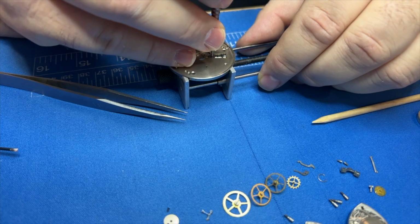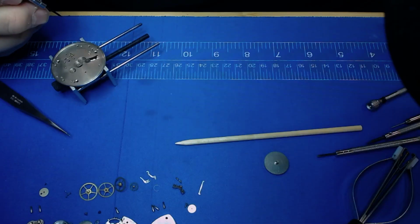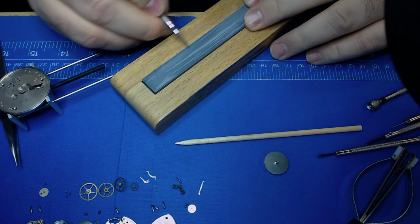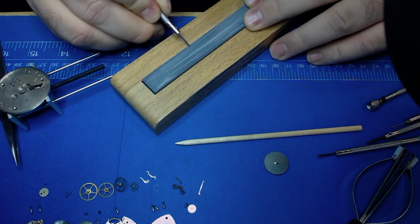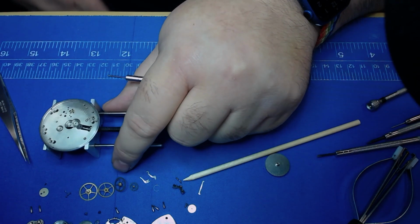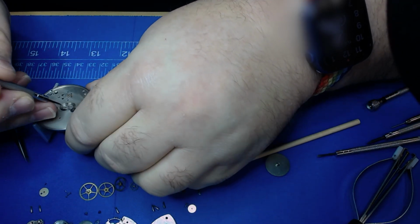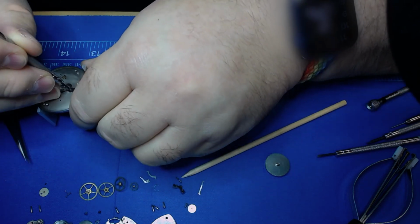So if I take this off, from the top down there's a screw, and then there's a little disc with one end that's been flattened off. My screwdriver's not good enough. This is the problem with cheap screwdrivers, is if you don't have sufficiently hardened tips, when you deal with a hard screw they twist. Or sometimes it's just simply a case that your screwdrivers do not fit that particular screw. So having an Arkansas grinding stone, sharpening stone, or something similar to that is kind of handy. I'm just able to sharpen the tip so that it fits that screw now.